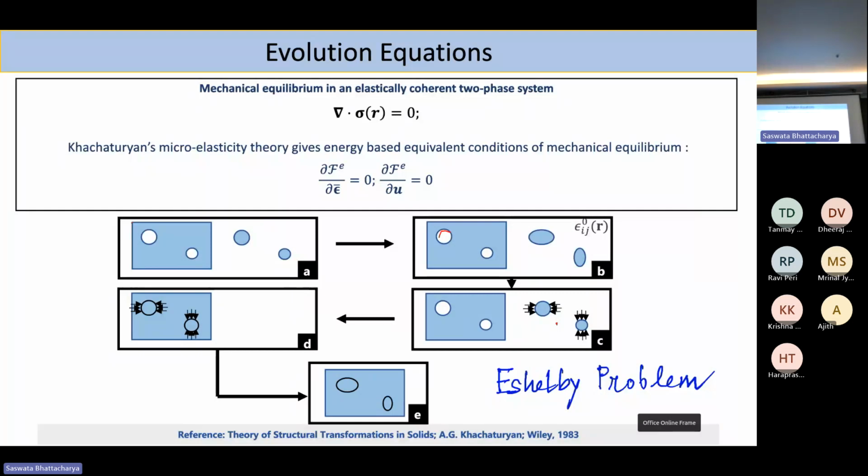But one thing I tell you, this is where, if you are using the Laplace equation, that is what is solved. Only thing that I want to tell is, in solid mechanics, when you solve sum of forces equal to 0, or divergence of sigma equal to 0, what you are taught is that traction, the force per unit area, is nothing but F_n equal to sigma dot n.